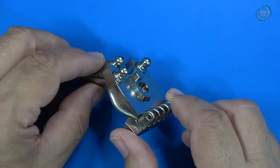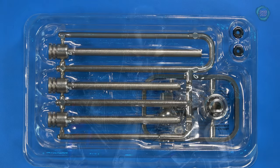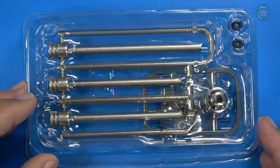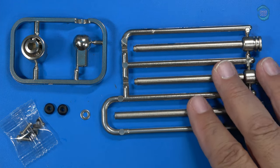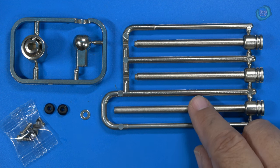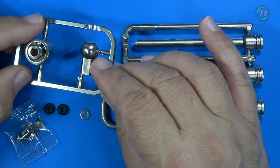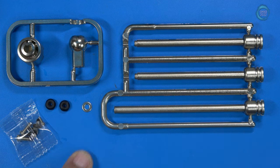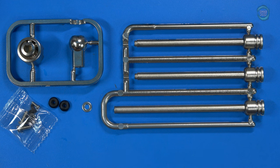Here's the parts pack for stage 68 — we'll be fitting the ankle joint to the right leg. Here's a close-up: everything is attached to sprue trees. These are the leg lower connectors — there are two of them and a longer one. We also have an ankle ball joint and an ankle socket, which will need to be removed from the sprue. We also have rubber washers, a plain washer, and we receive two 1.7 by 6 millimeter screws and three PWM 2 by 5 millimeter screws.